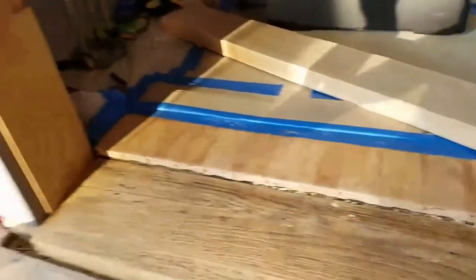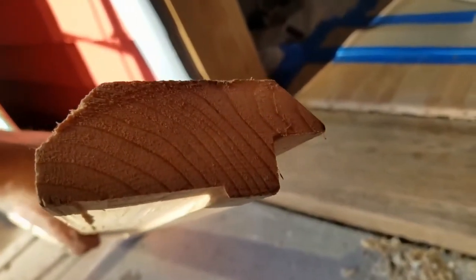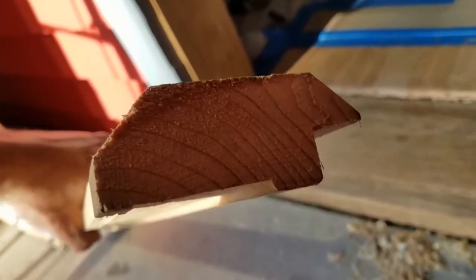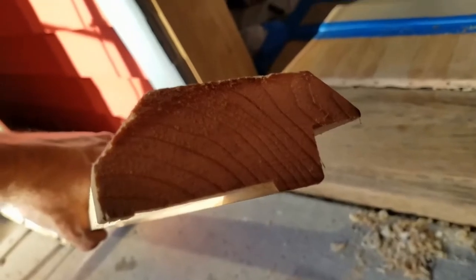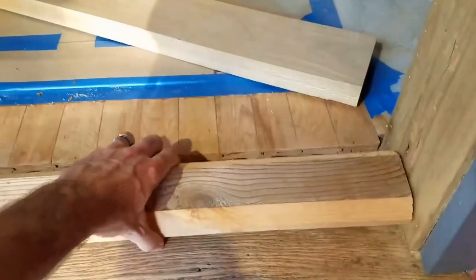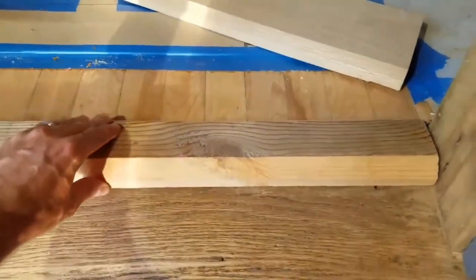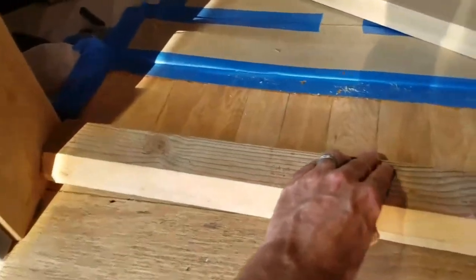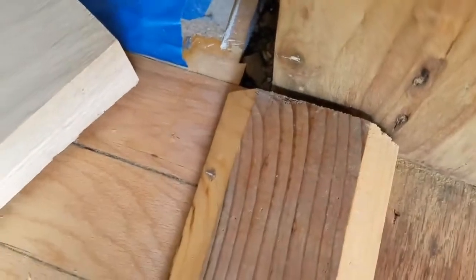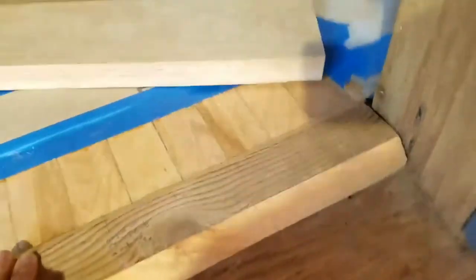When we're done, it will overlap the second layer flooring to the right. We'll use the bottom section here to level it up front and back. We'll kind of hollow out the middle and it will fit just like so. And then we'll have a nice threshold.